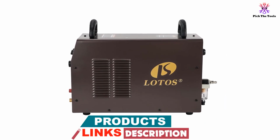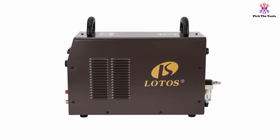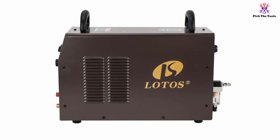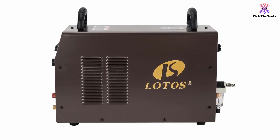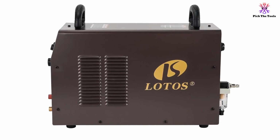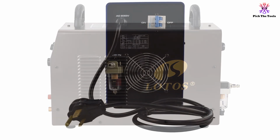This unit uses a MOSFET transistor that gives you a clean cut on thin metal, while also reaching higher power output levels for fast cutting through thicker metals as well. With the combination of the MOSFET and the pulse width modulation, you get an even, concentrated current on whatever surface you're using.